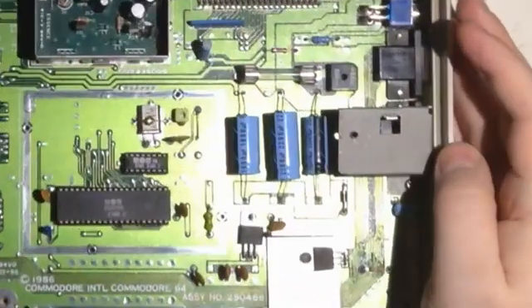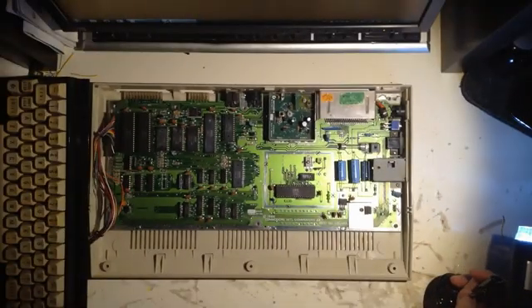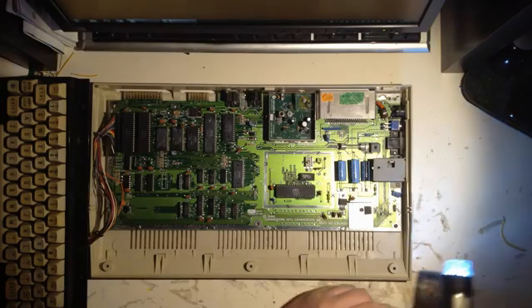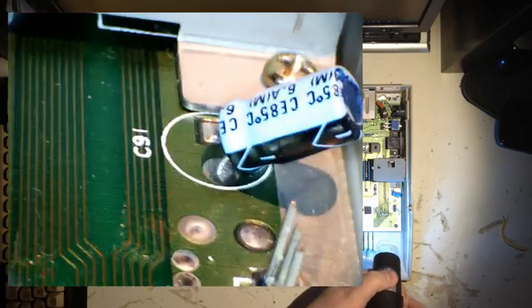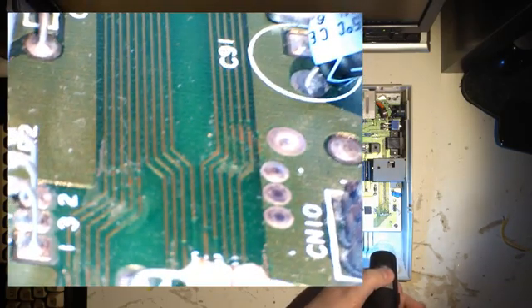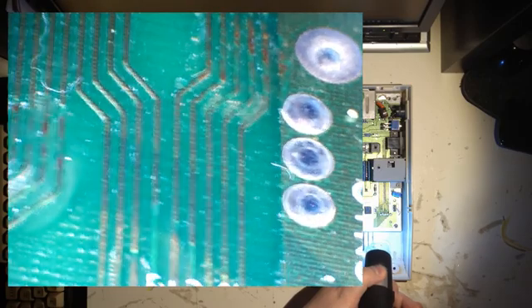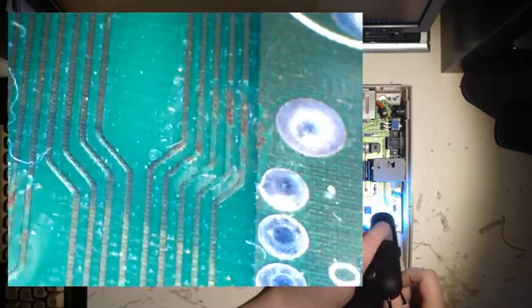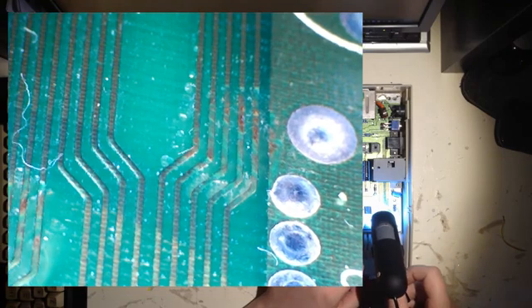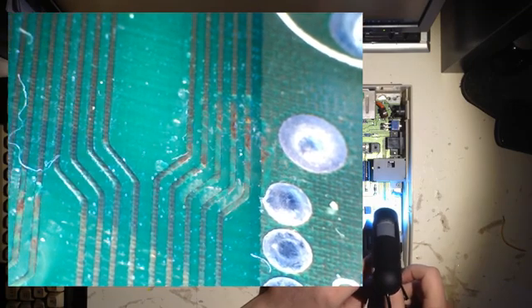You can see here — no corrosion. Actually there was some corrosion down here. I can show you with my microscope. You can see down here there's a cap of the tower, and there doesn't seem to be any leak. But if you see in the middle of the picture here, it seems to be a dimple. It looks like there's been something there, and here you can see exposed copper underneath the solder mask.